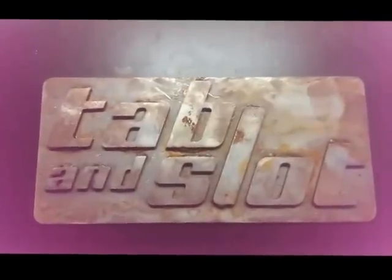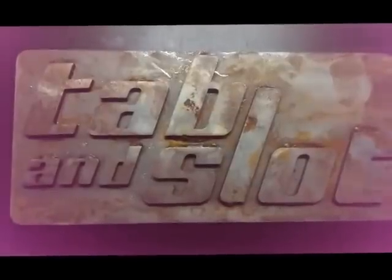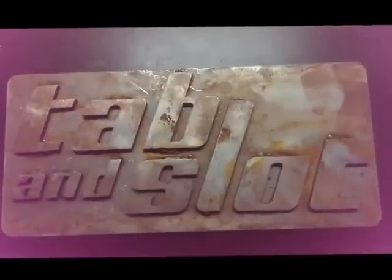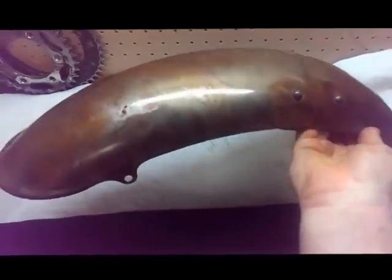At about the half-hour mark I've gone ahead and removed the cloth and gave it a light wipe down. What happens is you get a very heavy coating of surface rust, but only about half of it has actually penetrated the material and is sticking at this point. So I wiped it off and then put another application of vinegar on there — that creates the effect where you've got some depth to it, where some parts are very heavy and other parts appear to be the untreated mild steel. I'm going to cover this back up and leave it for probably another half hour or so, and then at that point we may be ready to put a final treatment on it.